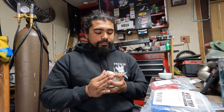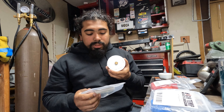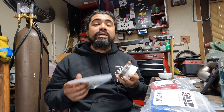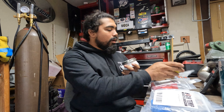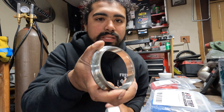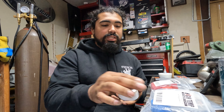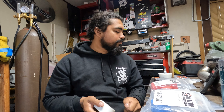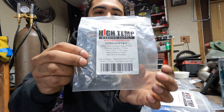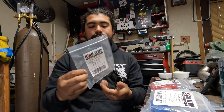I have three inch - so I have the part numbers for them right here. For the white one it's three inch up to three and a half inch because they are tapered, so you can fit whatever size between three inch and three and a half inch. I will say though it doesn't necessarily fit three inch perfectly - it just barely does and you kind of have to squeeze it very tight to get it inside. On a V-band it's a little bit wider than three inch because you have that recessed inside there with the little lip. It fits perfectly fine onto the V-band, but on three inch pipe you do have to squeeze it in a little bit, though it does seal perfectly. Hopefully you guys can see the part number right there.